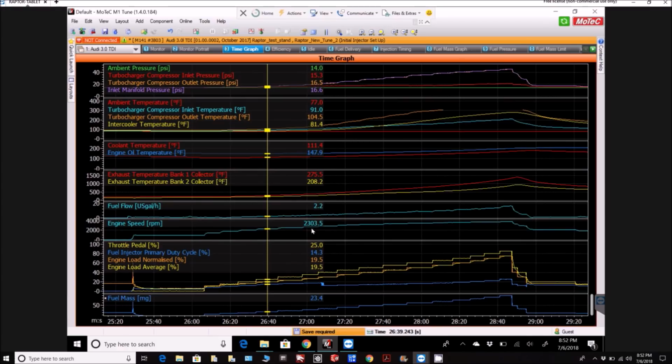It's amazing, really. Anyway, stepping up through the different power settings, there's again sort of 3000 RPM, 5 gallons an hour. It's not until you get pushing it quite a bit harder that the fuel really cranks in when the boost kicks in. So there's 7 gallons an hour, and there we are, getting a little bit higher again into the teens, and here we are at the maximum.